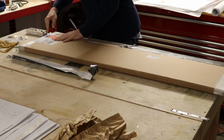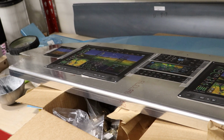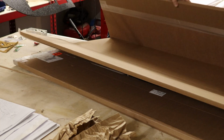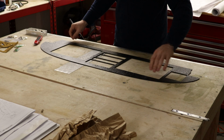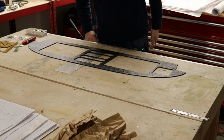This second piece is a temporary avionics panel. The one from Vans that you've seen me drool over before is, I think, 16th inch aluminum, and eventually I'll wind up having that CNC cut to house all of the pieces that are going into it. But until then, I need something that's a little more malleable and a little less expensive if I screw it up. That I can really fine tune the positioning of these, then make a final file that matches that and take it to a fabricator to cut out.